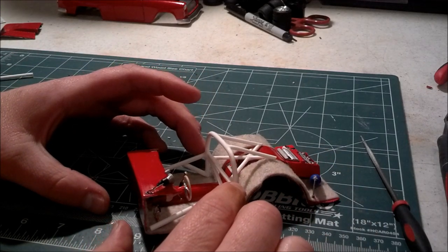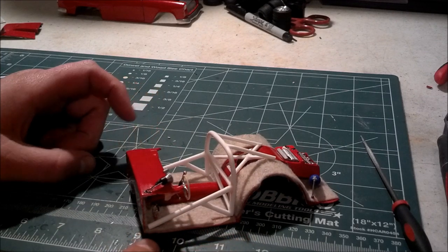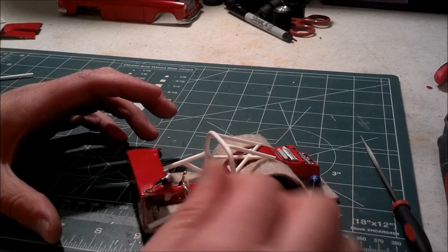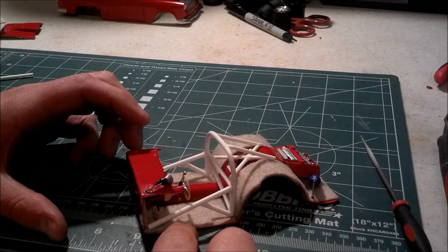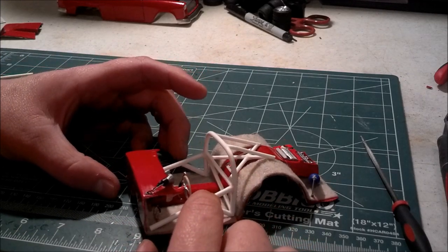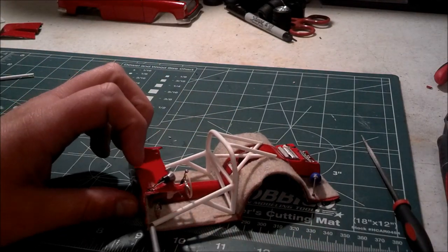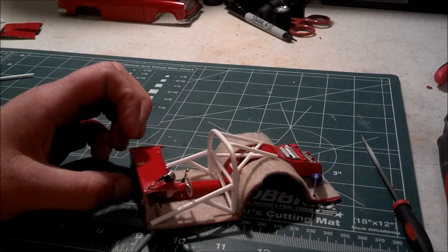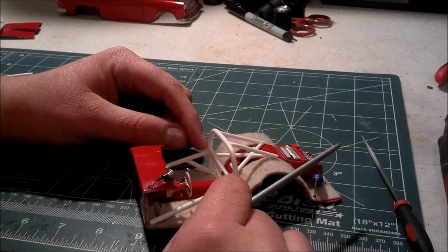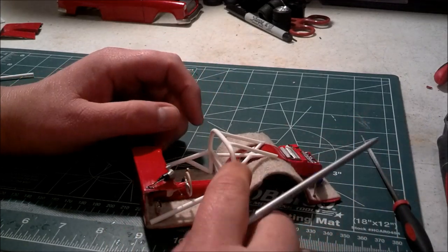You're going to measure from the center of your hoop on each side to wherever the front bars are going to go. If you're going to take them to the corners like I did, you can do that. If they're going to come out and then go straight down, you can do that. Again, you're going to have to do the cold roll, okay, and do it that way. So take your measurements, okay, cut those two pieces, okay, and do the same thing. You fish mouth the ends that are going up against the hoop, okay, angle cut the opposite ends to whichever angle they're going to be to where their mounting point is, and again, get your glue, put a couple of dots on either side. It may require a little bit more glue than normal, just because sometimes these tubes get finicky.